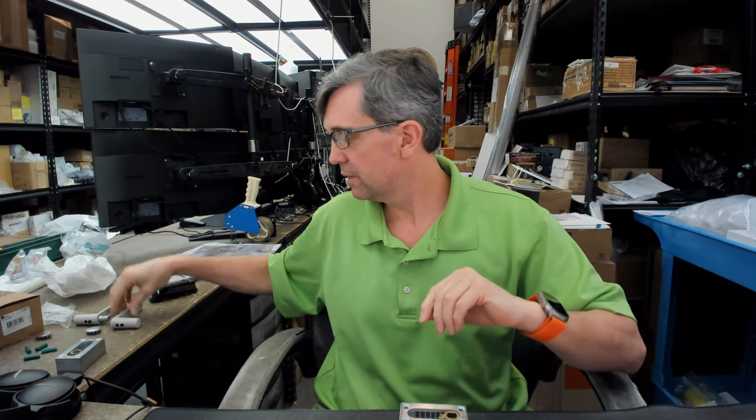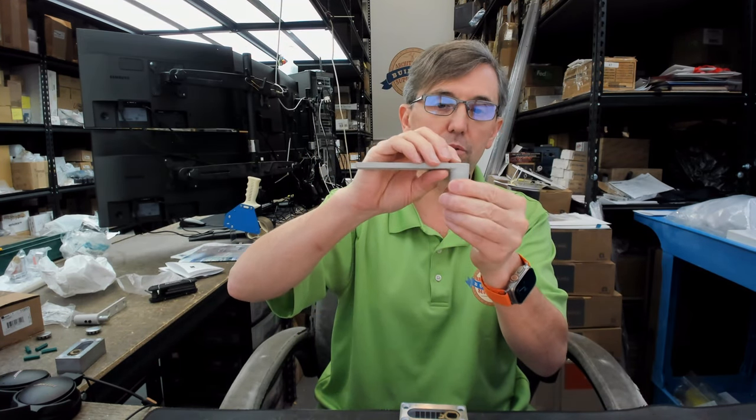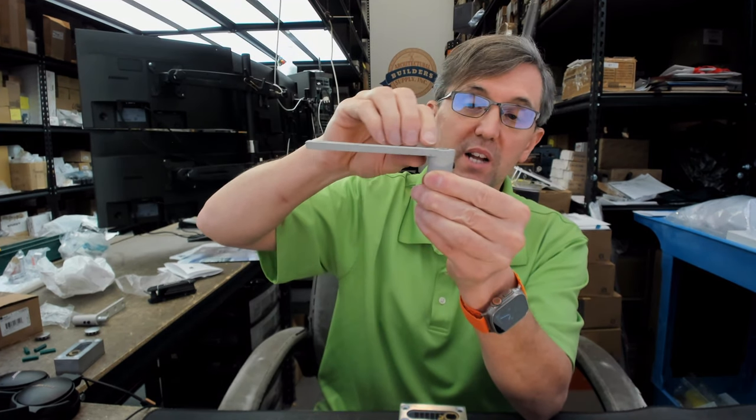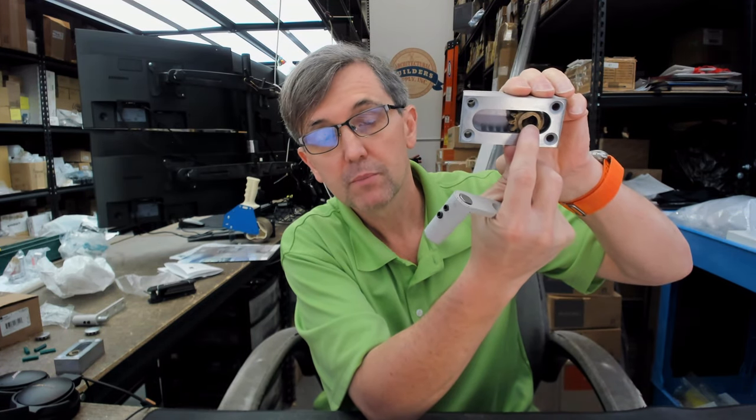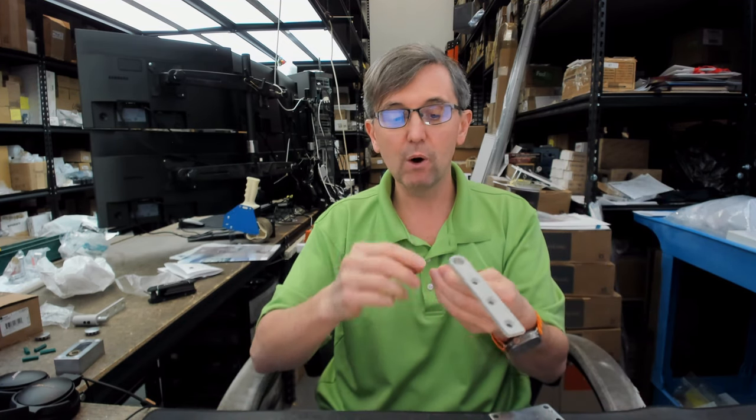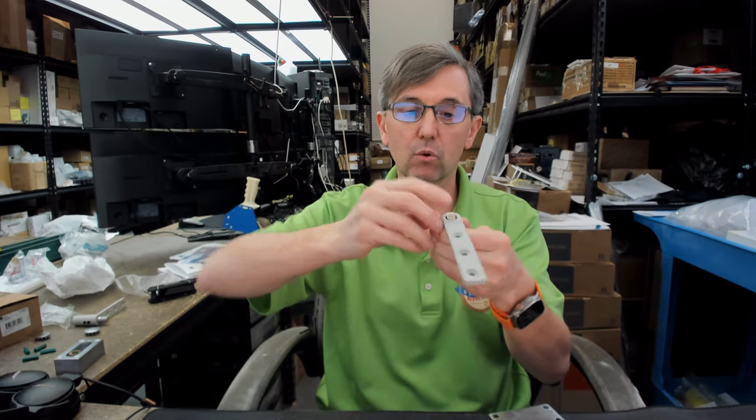Once everything is in place, you'll take that door, tip it in, move it up, and rotate the door. What you might want to do is loosen that set screw as you bring it close and then release the set screw, so that you can get the pin to fire up and find its location in the pinion. Okay? And that will pop into place, and then you're locked in place, so to speak. In order to get that out, you'd have to work that pin down in order to service it, tighten the set screw to keep it retracted, to get the whole opening out.